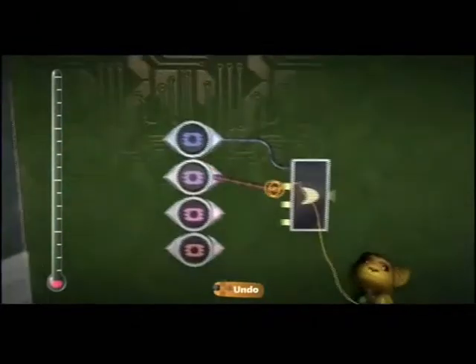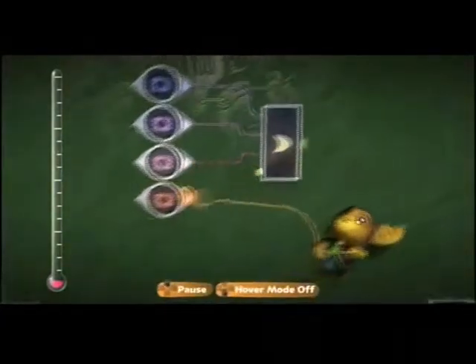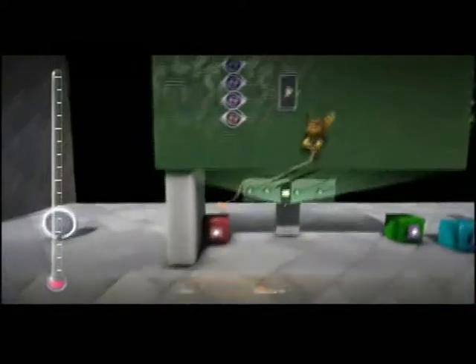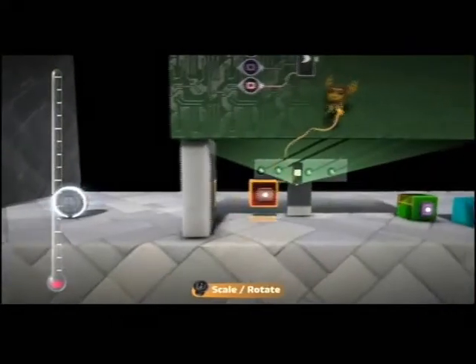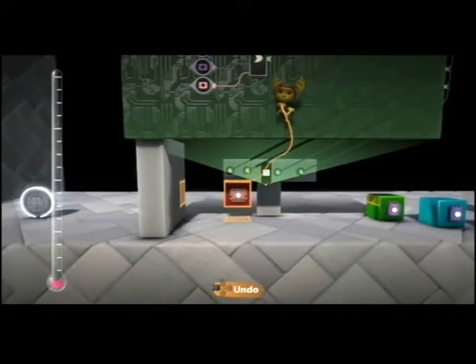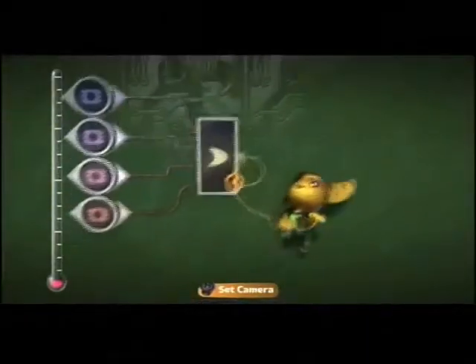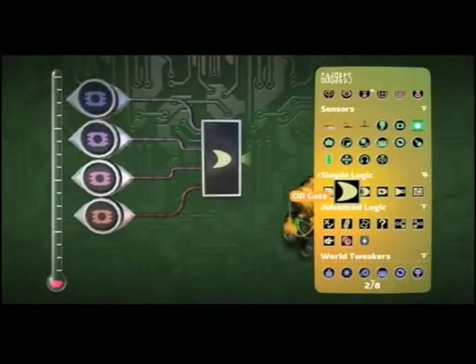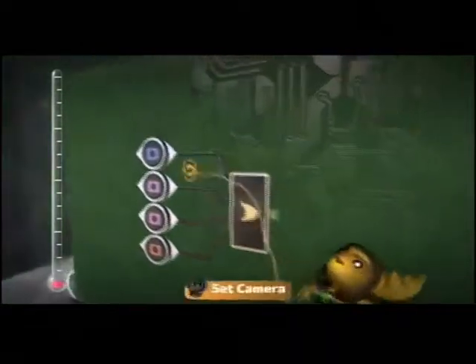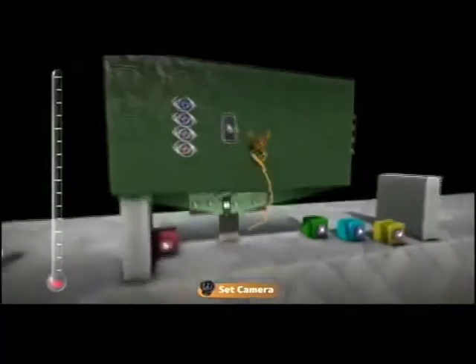At the moment these are all on zero because there's no signal going through them. But if I move this one a little bit closer, it will get about a 50% signal and pass that through the OR gate — and there's 100% or so. So this will take the highest one, so we now know what the highest signal is. But we don't know from what box it came from — we just know the value of the highest signal.